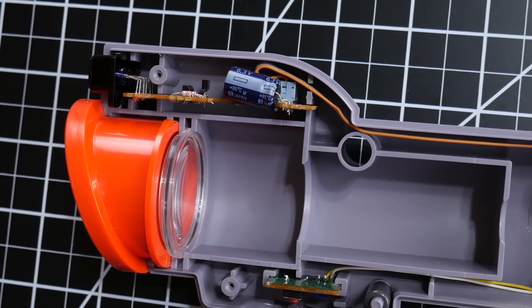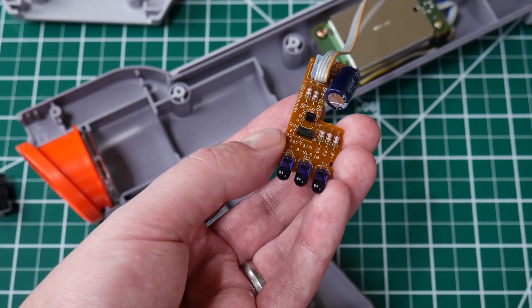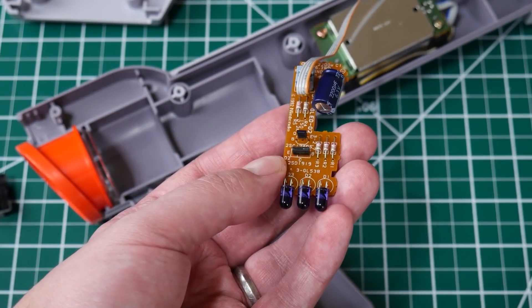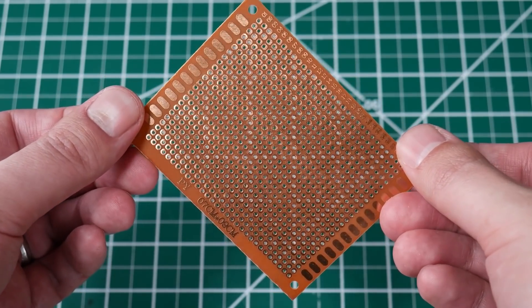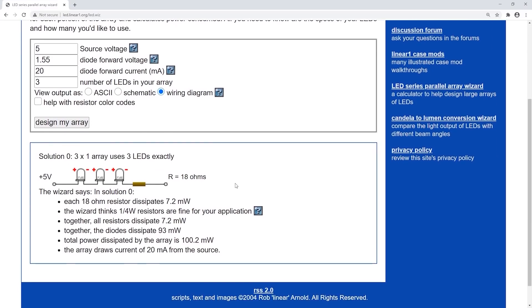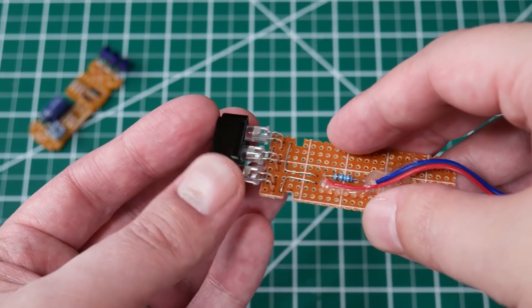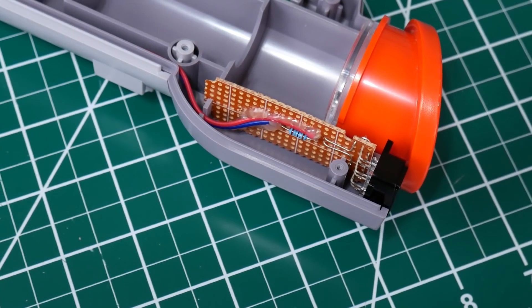The SuperScope has infrared LEDs that send encoded information about button presses and whether the photosensor is picking up light. These ones are almost 30 years old and I don't know their specifications, so I'm going to replace this board with a simpler one and some new LEDs so I'll know the wavelength, forward voltage, and forward current. I'm using Bakelite perfboard, which is great for prototyping because you can cut it with regular scissors. I've traced the original board for accuracy, and wired the LEDs in series with a current limiting resistor calculated using an online wizard. The LEDs are spaced identically to the original, so we can continue to use the plastic cap. I'm really happy with how this turned out — it fits perfectly.